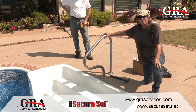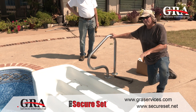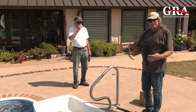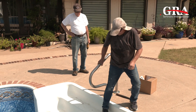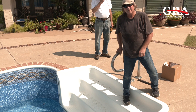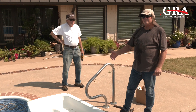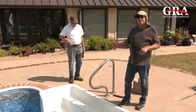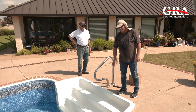The presumption is that water from rain and pool activity got in around the seams of the steps and gradually over time either moved or helped compress the sand underneath. So what we're going to accomplish today is put a permanent layer of high-density foam under those steps, primarily to help with the stability of the substrate or the sand, but also to eliminate the flex on the steps — because over time that constant flexing of the fiberglass could possibly end up in a crack or fissure. Next phase is getting the kits ready and starting the injection phase.